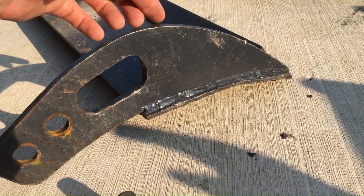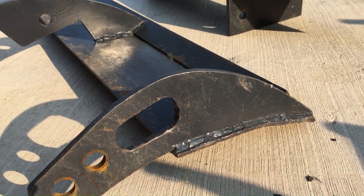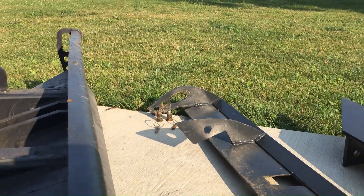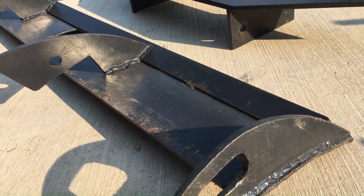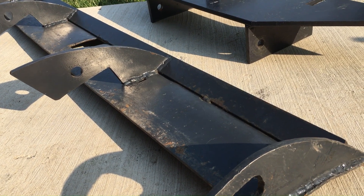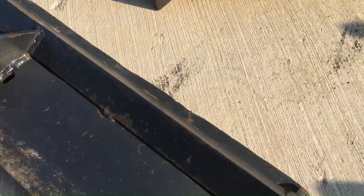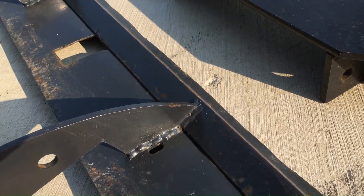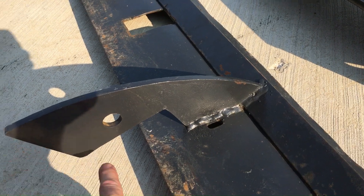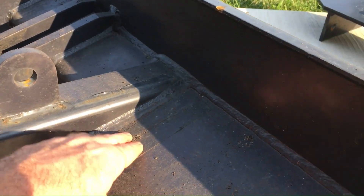For the next template, I decided what kind of curl I wanted to give it and then did the same for the opposite end. But I was concerned that probably if I'm pushing with all the force that a machine like this has, I'd be bending things. So I ended up adding a piece of angle iron for reinforcement at the top, and these support legs that come back and rest on the machine itself.